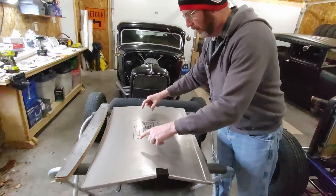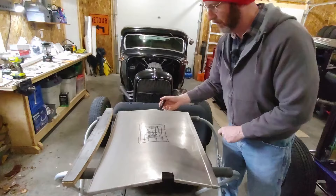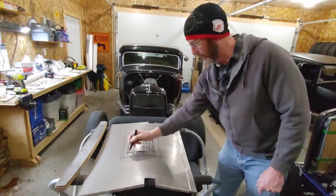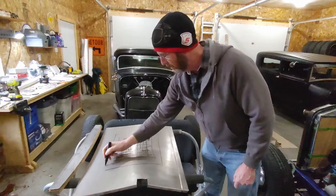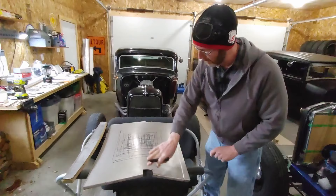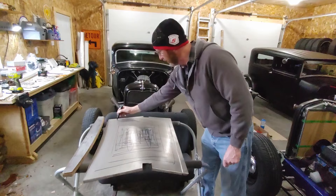That actually provides a crown going both directions. So you start with a small square, work to a bigger square, going over everything, then progressively go back and forth on the English wheel, carrying on until you've got basically a piece of metal that's crowned this way and crowned this way. I went pretty much out to the outer limits on it.